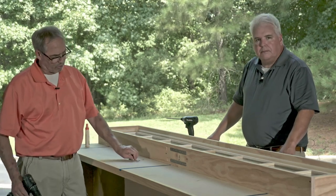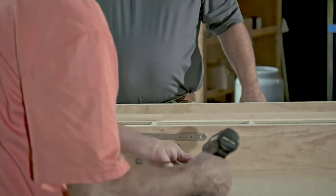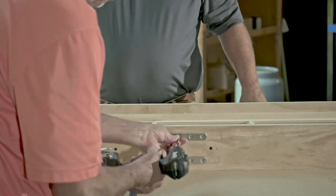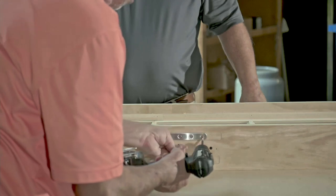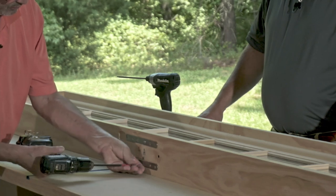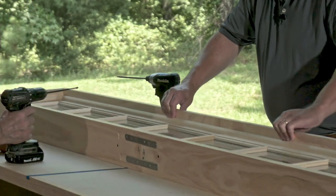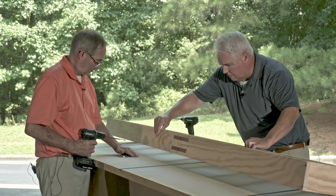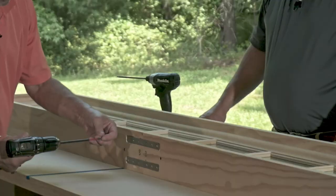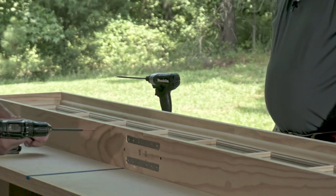So how are we going to do that, Clay? The next step is to screw the straps in. The straps are also designed to pull the parts together and they will make the unit really, really stiff. Once you have the halves lined up, there will be three screws on each strap — just go ahead and put them in there. They just have to be snug; you don't have to hammer them in. And that side is done. We'll flip it over to the next side. Notice the B side — you won't be able to put them together the other way, but it'll speed you up a little bit to try and get it aligned the first time.